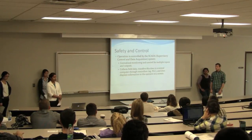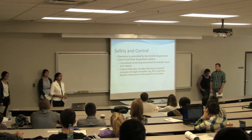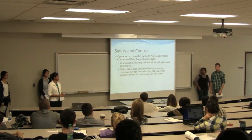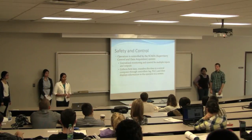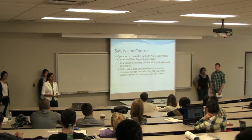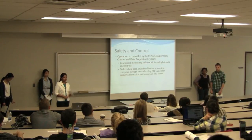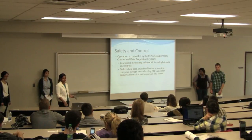SCADA allows the operators to monitor the system in real time, and you can also set the set points manually. There are operators monitoring the control 24 hours a day, 7 days a week, and SCADA uses standard control algorithms such as PIDs to maintain safe levels.